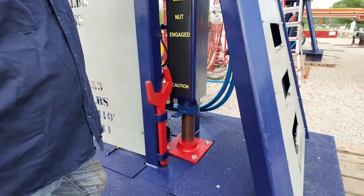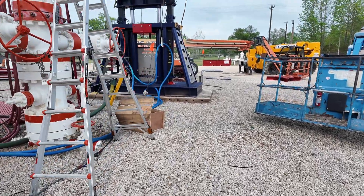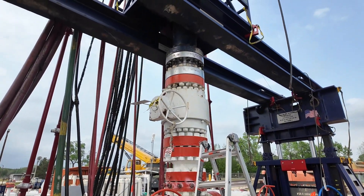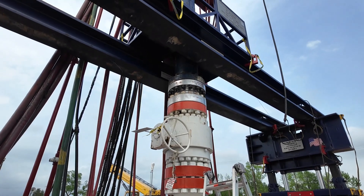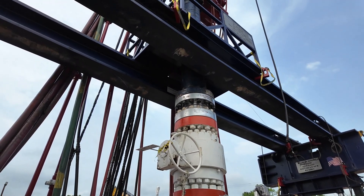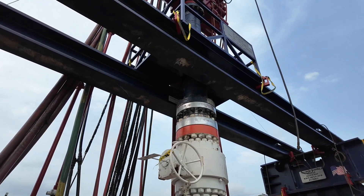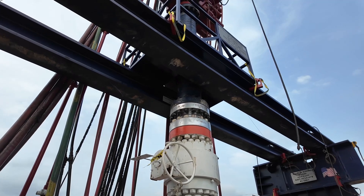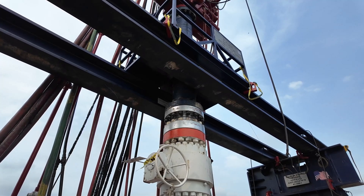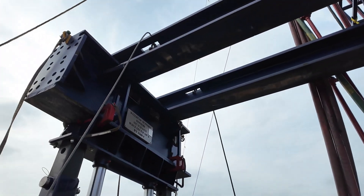Cool deal. Let's walk around and look at the wellhead itself. We have a 10-foot spool right there on top — that's what we're grabbing hold of. That's what the beams are sitting under. We get our cross beam set, put our base plate down, and we have a standard bowl and slip. We get the bowl and slip around the spool, set it, and we calculate our weight of what we're picking up right above our cylinders — generally on the average of around 40,000 pounds.